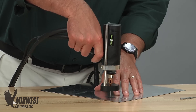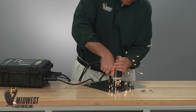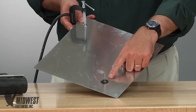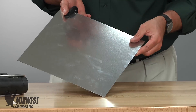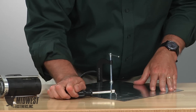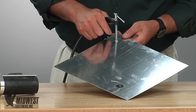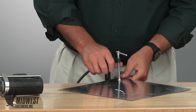The equipment recovers instantly as you break contact with the welded pin and is ready for the next weld. The welded pin shows no backside distortion or burn through, with the weld providing good strength from the bond. The strength of the CD weld is strong enough to fail in the fastener before it fails in the weld when applied properly, ultimately giving us superior strength for holding material in place.